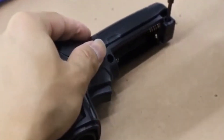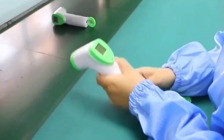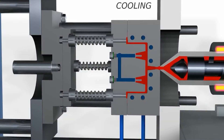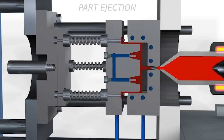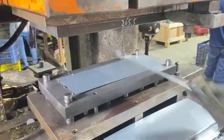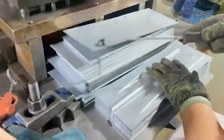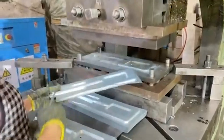Depending on the type, model, and manufacturer, a thermometer may be bought with a plastic casing or a metal casing. To make plastic casings, manufacturers use injection molding — plastic granules are melted and injected into molds to form the desired shape of the thermometer casing. Metal stamping or casting is where metal sheets are stamped with the casing molds, or molten metal may be poured into a case where it cools and takes form.